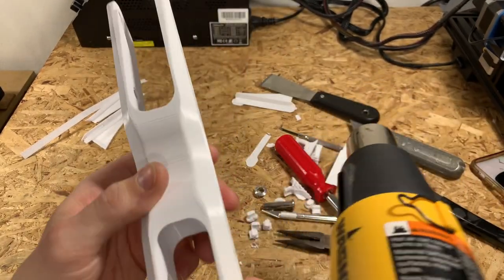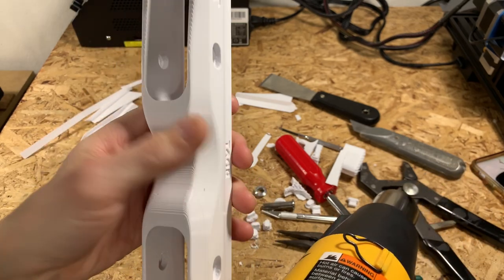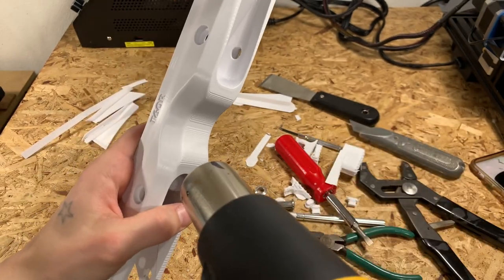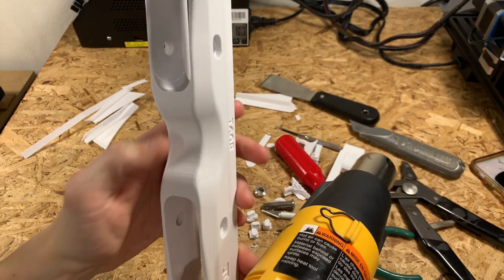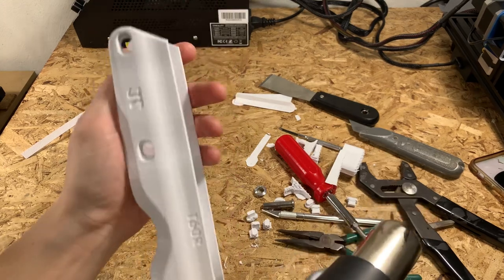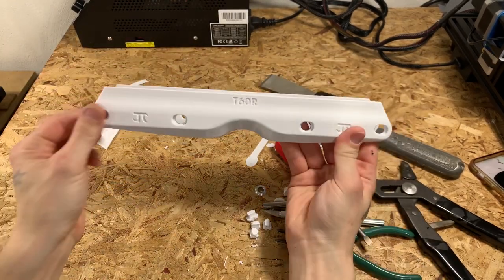This is not a heat treatment. A heat treatment would be heating the whole thing all the way through to about 200 degrees Fahrenheit, depending on your filament, but frames are really hard to heat treat. All this is doing is basically cleaning up our little ugly bits of plastic. If you overheat it, you run the risk of your frame shrinking wherever it was overheated, and then spacers, axles, and wheels won't fit — the wall may not even fit on the 5050 core. Just a light coat. I've got a little bit of Z seams on the inside of this groove — you can heat them up a little bit and flatten them with your thumb. If the plastic is too hot to touch, you've gotten it too hot — set it down, let it cool, and make sure it fits on your core.